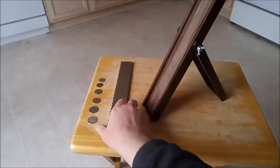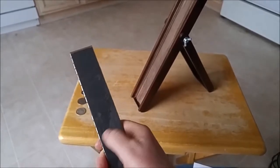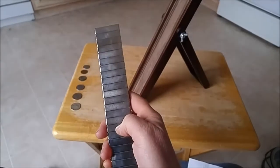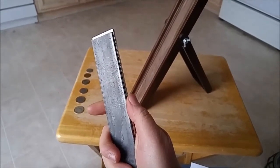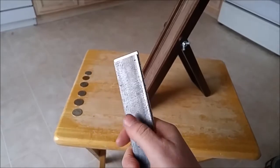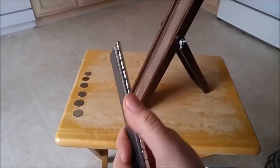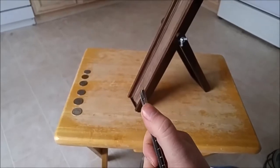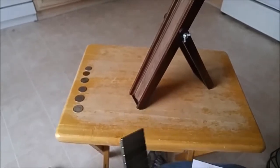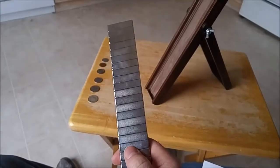The magnet assembly is two pieces. There's an eighth-inch thick by one-and-a-half-inch wide iron bar on the bottom side, and on the top side there's a series of magnets. The iron bar is used to focus the magnetic field on the top side where you want it — without the iron bar, you'd have magnetic field coming out the bottom too. It effectively combines the magnets like a horseshoe magnet, with all the magnetic field coming out one side.